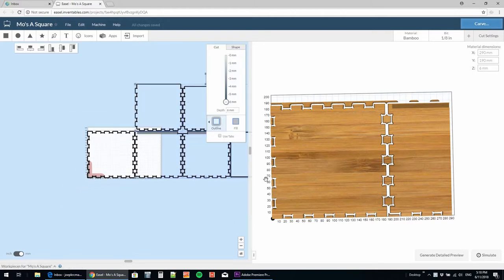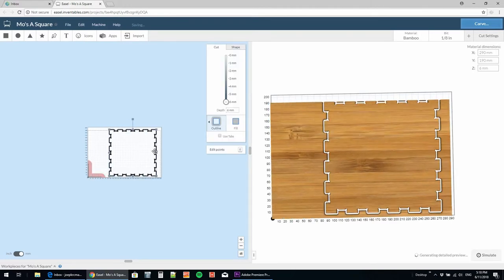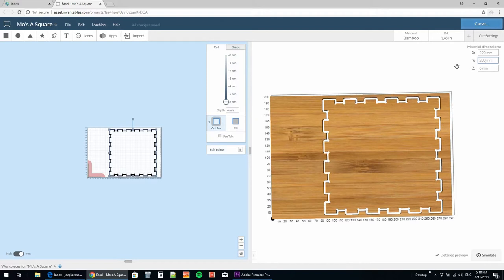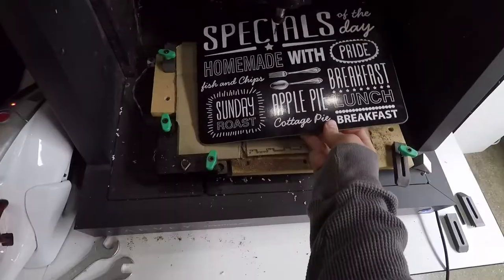Then all you do is import it and Carvey will lay the toolpath onto the workpiece. Now since I'm doing one large square at a time, I'm going to delete the other five squares, carve that one piece, and then go back and undo it and move on to the next square. Then I'll move and center the piece because the Carvey won't let you use the left-hand corner — that's where the Z-stop button is. I can then press simulate and see that it takes about nine or ten minutes.